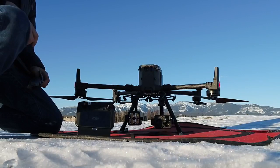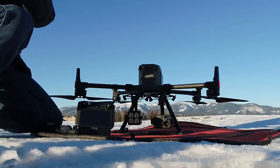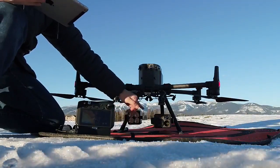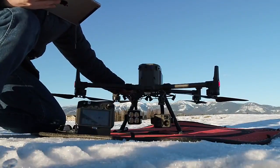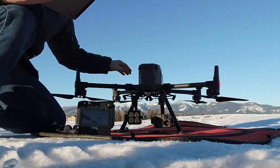Mike's firing up the 300. So we've got the M300 fired up, we've got the Z15 spotlight and the H20T going. Make sure all of our booms are locked. Check over props, do the basic pre-flight stuff. Definitely make sure these booms are nice and snug before you're taking off.